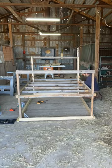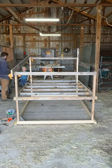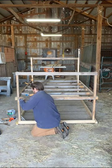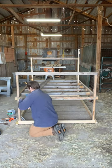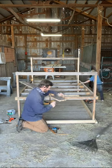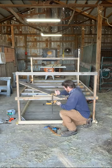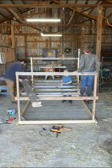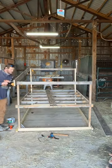Up next we've got to put up the roof rafter. I went ahead and mounted one on the side with my clamps, traced out the outline, and cut it out with my coping saw. I can then use that rafter for the middle — it will sit lower — and trace that out so I know exactly where to put the other ones on the sides. That way they'll all be even and flush so that when we put the metal roof on, it'll fit nice.